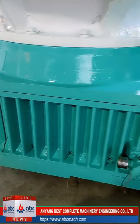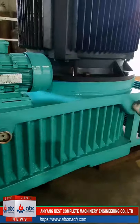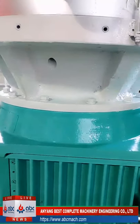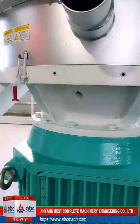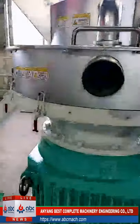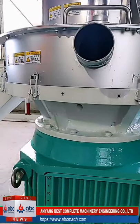You see, this is the gearbox we have, the durability gearbox. The motor connects with the shaft, and the shaft is driven through sections 1, 2, 3, 5. When it goes to the back sections, the power will drive here. So here in the motor, it's turning power, right? It's turning round by round. And when you come here, you see the main shaft going up and the roller is turning. This is the stable part and this is the turning part. So between the turning part and the stable part, there must be a bearing, right?